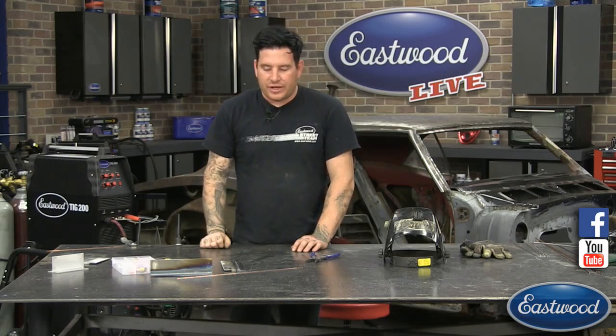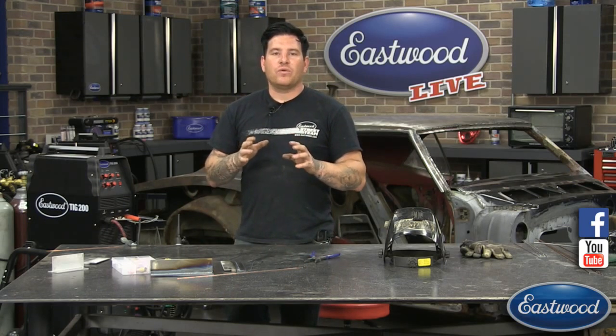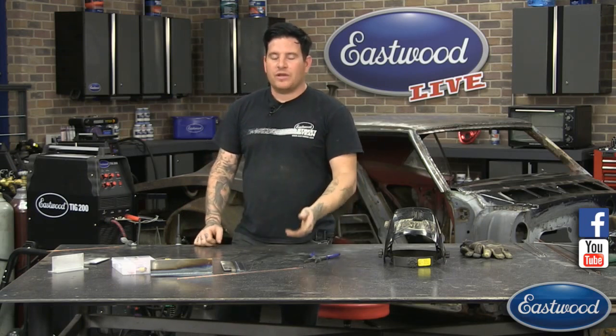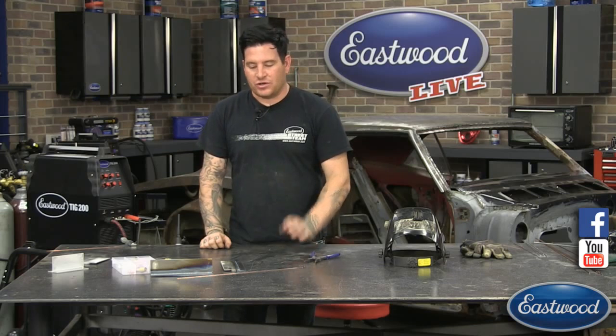But the nice thing with TIG welding is you can see everything that's going on. So MIG welding, it's a little more difficult sometimes, especially if you're doing spot welds or stitch welds. It happens so fast you can't really see the puddle. Your brain can't function what's happening quick enough to make any of those changes. With a TIG welder, you have a pedal and you can see the puddle, and I can tell if my puddle's not large enough or if I need more heat, I give it more pedal. So you can actually do it on demand, which is nice. So TIG welding, you really got to watch your puddle more than listening. You need to use your eyes more so on these.